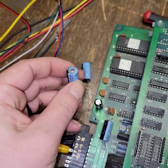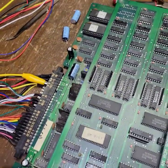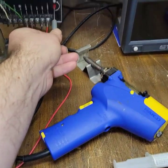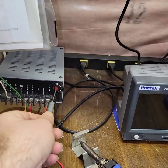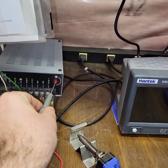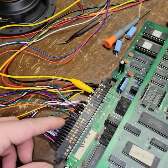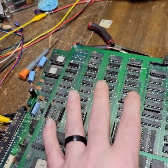Not that one. Not one there. That's definitely leaking. Now I just want to see — actually let's turn this down, because that is absolutely cranked. So I was getting 4.6 there. Let's turn it down to about there and I was probably getting a reset. I just want to see if changing out especially this cap gets me better, more stable voltage.